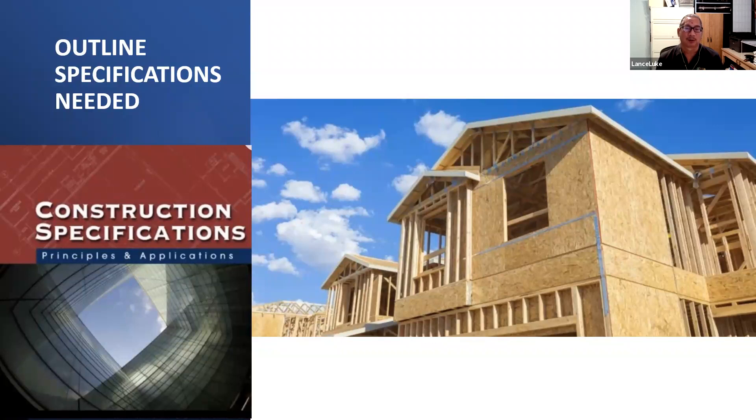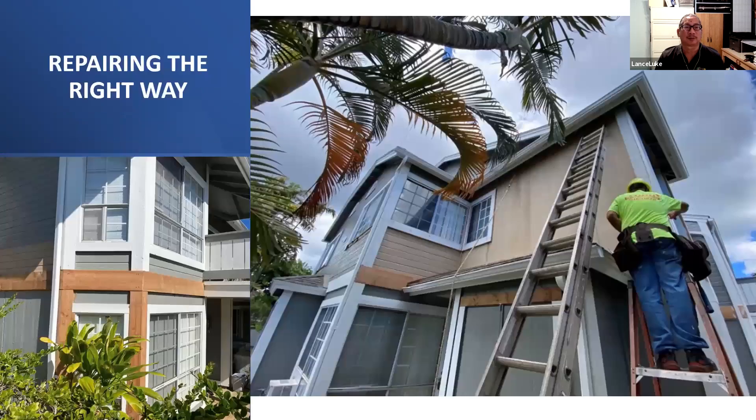You need to specify how much wood will be replaced. If there's a two-by-four trim that's only rotted two feet, do you replace the whole board or just the rotted section? Same with siding — if a two-by-two area is rotted, do you replace just that section or the whole four-by-eight sheet? There are reasons why you'd replace the whole sheet. The right way is to repair properly, which I'll explain with photos from a recent project.